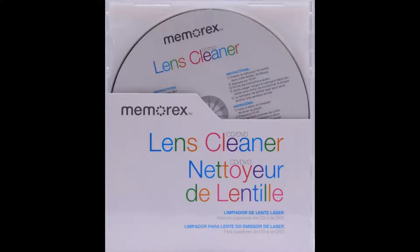The next series of tests are specific for Dolby ProLogic systems. If you do not wish to continue, please proceed to Track 13 now. This portion of the audio system setup is specifically for those of you using a Dolby ProLogic system. The first test will be for channel ID and imaging, to determine if your speakers are connected to the correct left and right terminals. My voice is coming from the left speaker only. My voice is coming from the center speaker only. My voice is coming from the right speaker only. If my voice did not coincide with the speakers stated, please check the wiring and then replay this track, Track 9.